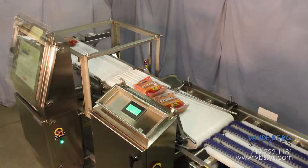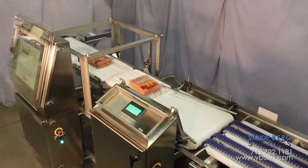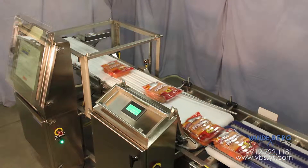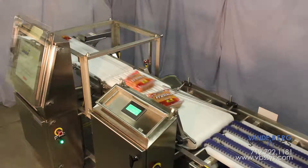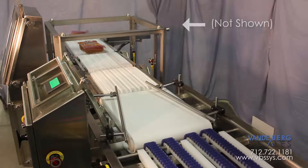The second function is to provide a matching speed to the conveyor scale. This ensures minimal product vibration as the product transfers onto the conveyor scale during the weighing cycle. Photo-eyes detect the leading edge of the package and the weighment cycle begins. The weighing cycle stops once the package reaches the second photo-eye. A Lexan draft shield protects the scale by minimizing drafts of air that might affect the weighments.